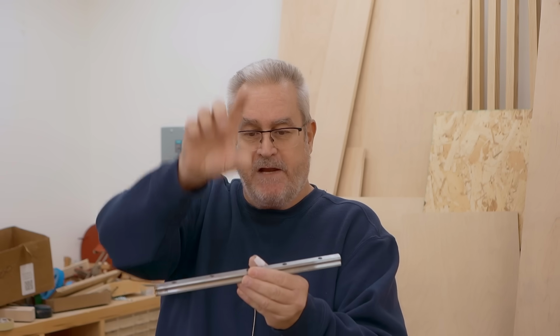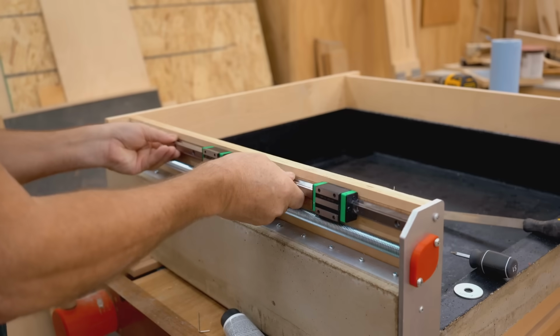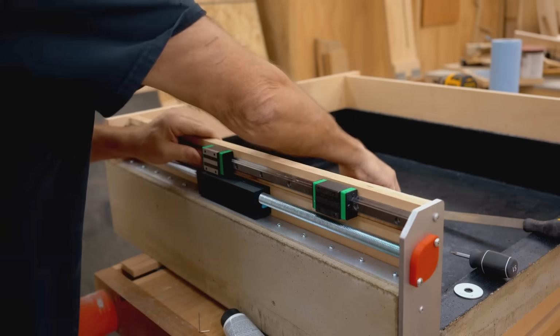You have to put the linear bearing on top of the concrete, and then where are you going to put the ball screw, the lead screw? Where's it going to go? Okay? If your gantry side comes down, it has to go outboard. And it adds to the width, and it makes it more complex to my way of thinking as I was designing it. So I made that compromise, okay? I added a very slightly weaker assembly to the top of the Y rails to fit all that mechanism inside. The lead screw at the bottom and the linear bearing at the top.